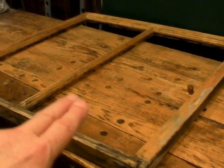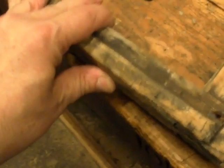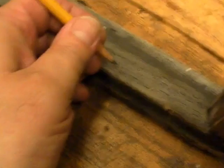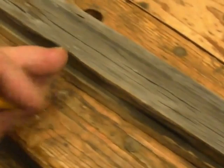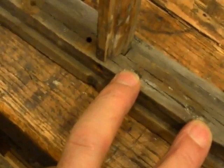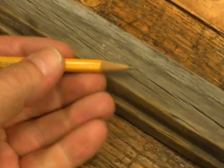I'm working on this two-light sash. I deglazed it, removing both panes of glass and all of the old putty and paint. I'm just taking a close look at the meeting rail here and I can see that it's full of weather checks, which I could repair with wood epoxy repair methods. There are also two sets of meeting rail lock screw holes that could also be filled with wood epoxy repair methods. And here's more weather checks right along the top of that rail.